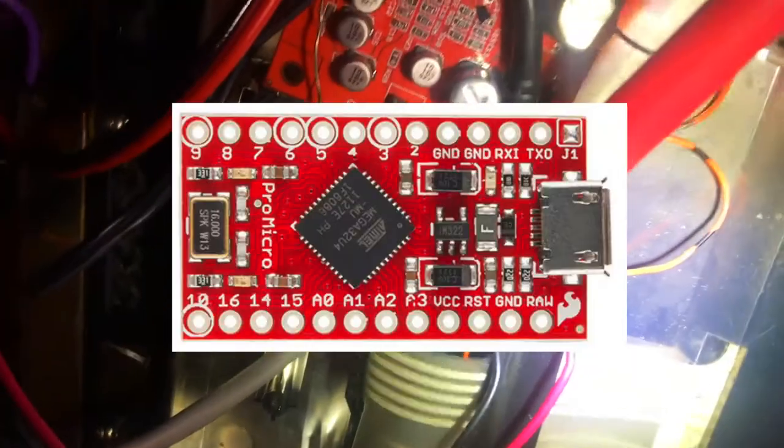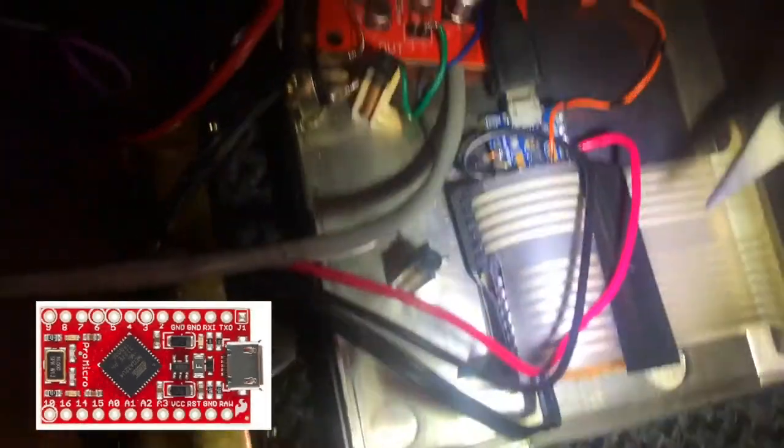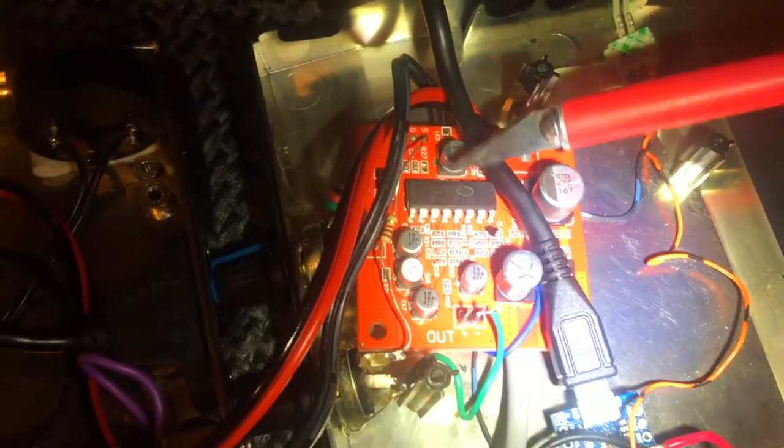A PCM synth Arduino underneath this ribbon cable that comes from the keyboard. That Pro Micro makes the sounds pulsing from a pin after reading these buttons and the touch sensor that's the pitch bend. Then it goes into this reverb unit with a chip like you'd find in a karaoke machine. There's the volume slider for it, and there's lights hidden underneath there.